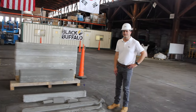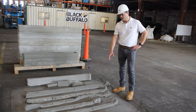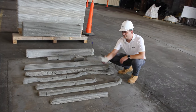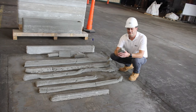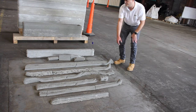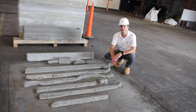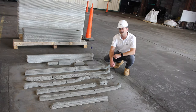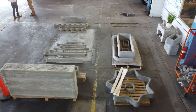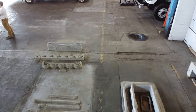We found out very early on with a lot of the mixes: if you're doing short runs, you have to be careful, making sure that all the layers can actually support themselves as you go up. We test things like how easy it is to crack, and we've tested all different kinds of fibers. Throughout different days, we have our printer set up outside — we want to replicate a real job site. We know there are going to be real issues with temperature and humidity, so we do change the ratio around. If we know a mix isn't working, we try to figure out what we can do to make it work.